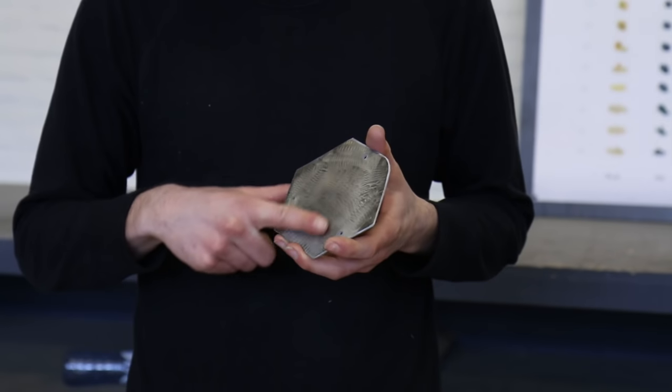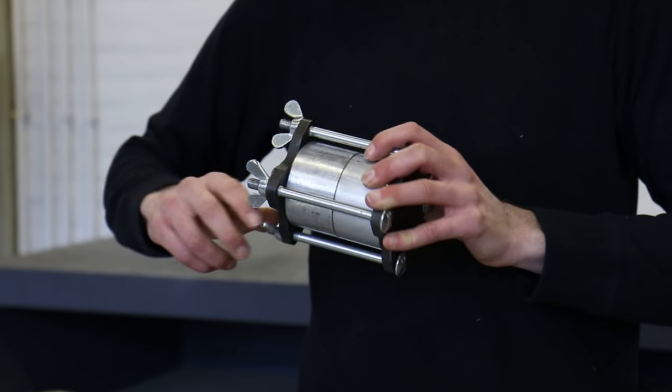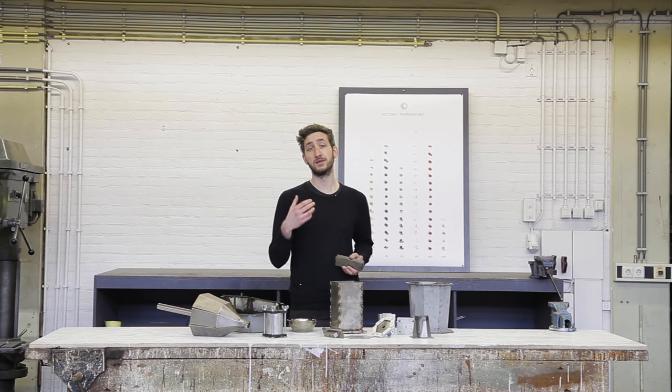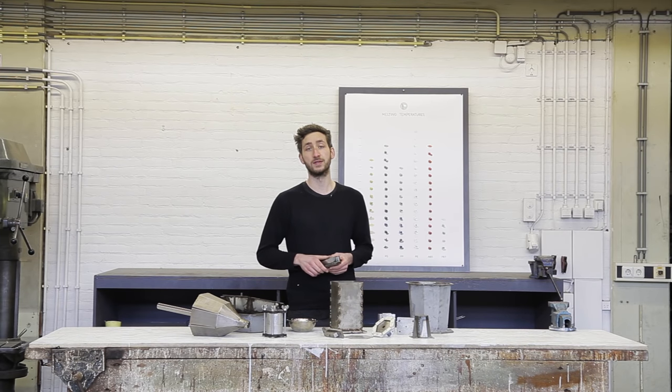Metal is a good material for molds because the plastic doesn't stick to it, and if it does you can scrape it off. It's also durable and can withstand the heat. Our machines work with a whole variety of molds — you can CNC them, weld them, or make them on the lathe. The more accurate you make your mold, the more accurate your output. If you put a lot of effort into your mold once, you can easily replicate more products. Prototype with different kinds of molds, but make sure your final one is accurate and well made.